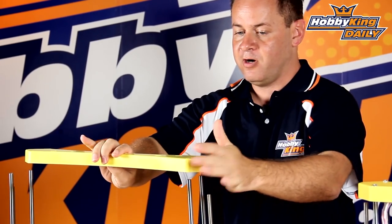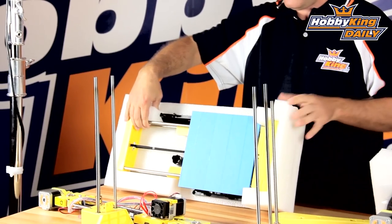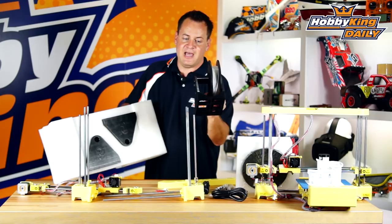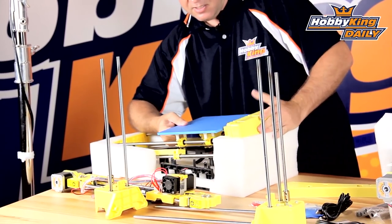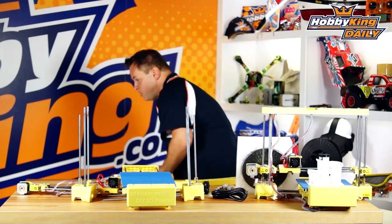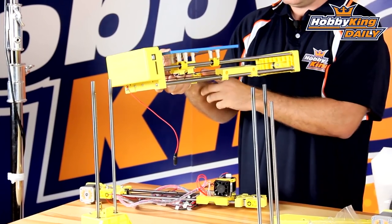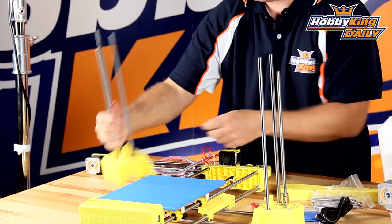All you need is a computer and about 15 minutes to get this all set up and printing. The next part laying on top is the top cap, which has four screws that go down from the top to hold it in place. The last tray is our actual bed on the gantry. On the bottom side is our spool holder, which can actually accept up to two rolls of filament if you have multiple colors. For assembly, it has two holes — you take the two noted spacers, slide them on, slide the rod through, put the spacer in between, and continue sliding the rods through.